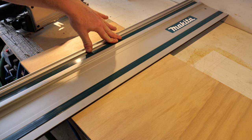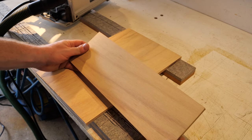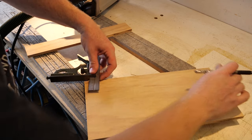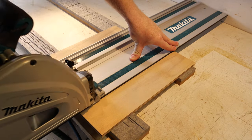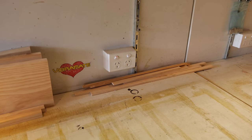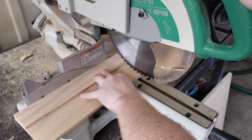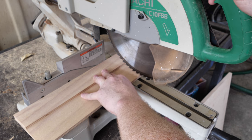Our lower back panel is 115. We'll cut them first, otherwise we'd have to keep measuring and allowing for the saw cut. The upper back panel covers the actual chassis, the lower back panel is 50mm. Then we've got the front face panels, top and bottom, which are both 45mm. I like to leave the front top and bottom panels until the cabinet's actually glued up — if it's grown a little bit in width, you can always adjust by making them a little longer.